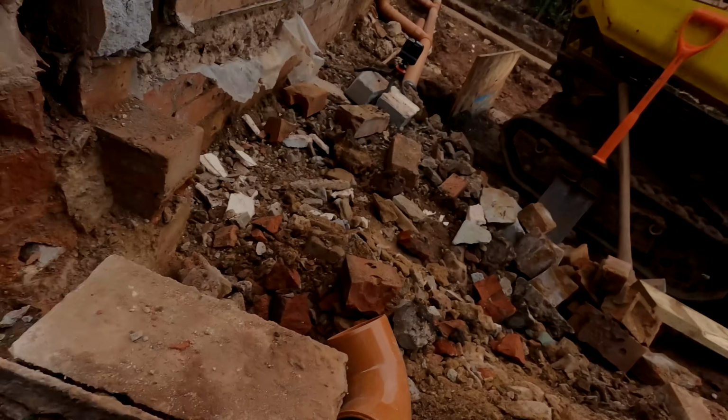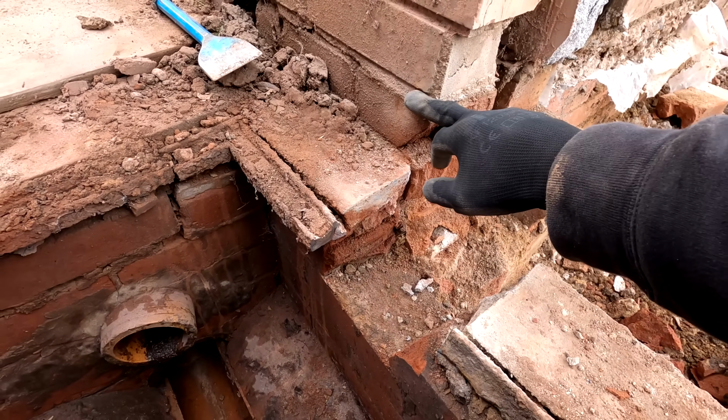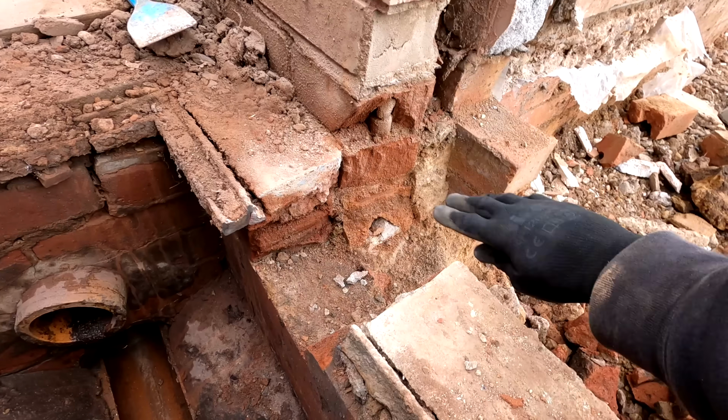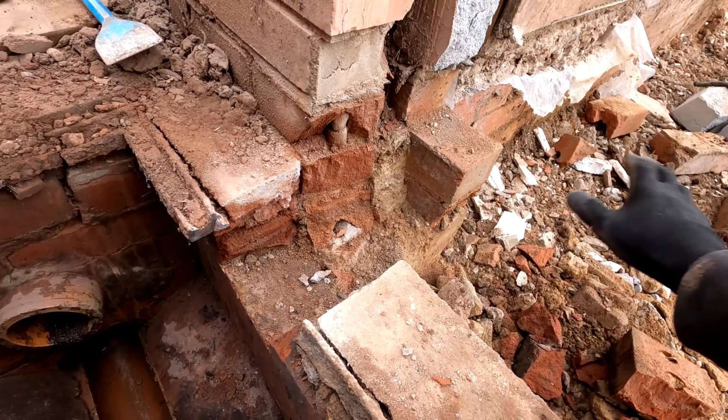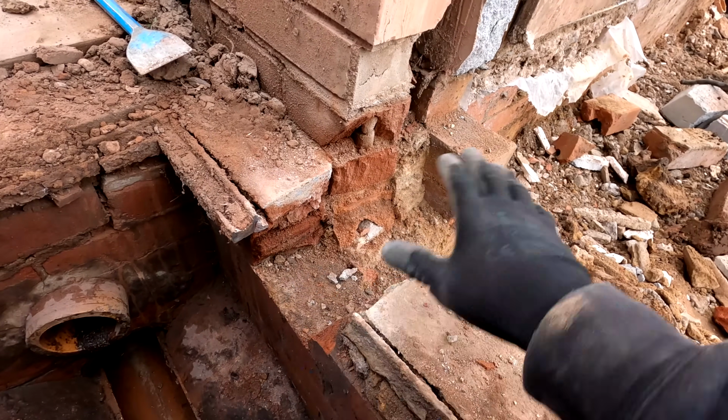So I've got my little route set out here. Our finished floor is going to be this height. It's going to be at damp, so I need to make sure that obviously this pipe work comes underneath here, but I also need to be above our block and beam so we can carry on getting everything through, and that won't cause us any issues later on down the line. We won't have to move it or anything.